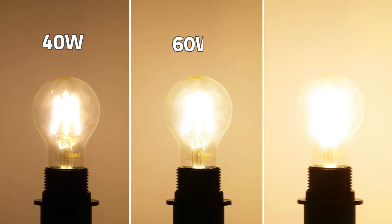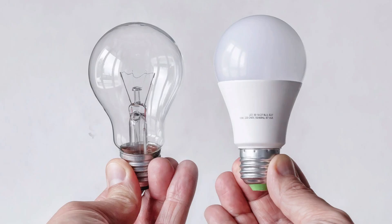Back in the old days, watts and brightness were pretty closely linked — a 60 watt light bulb was not as bright as a 100 watt bulb. But now with LEDs, watts don't tell you brightness anymore; it's just how much electricity the light is eating. A 60 watt old school incandescent light bulb made about 800 lumens. Today, a modern LED light bulb also makes 800 lumens but only uses about 8 to 10 watts. Make sure not to confuse watts with lumens.